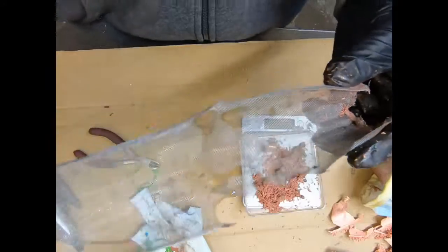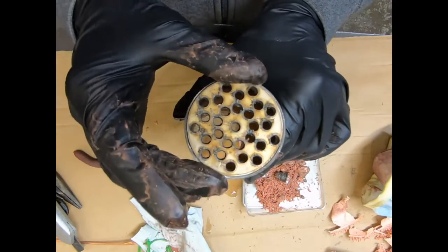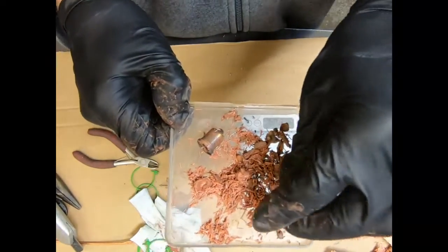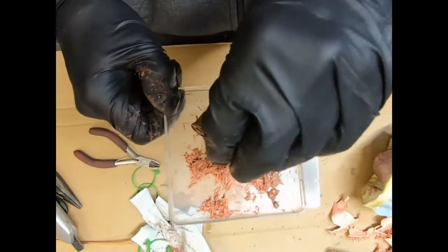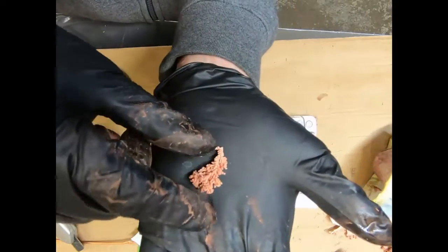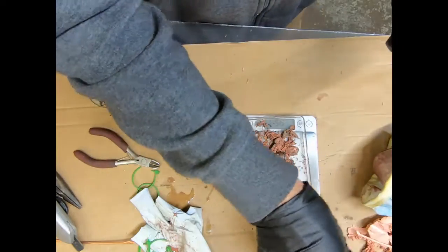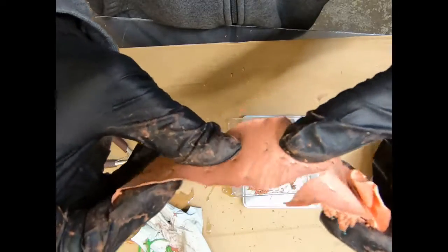If we use some good metal we're going to try some 304 stainless — this is going to be our anode basket. This is going to be the bottom of it and all the electrolyte is going to flow from the bottom up through the top to carry that sludge out. There wasn't a lot of sludge in here for the simple fact that this was already fairly pure stuff. Those crystals are really cool and look at how pure that is. I'm going to call that a win — we successfully bypassed the anode smelting and casting process.